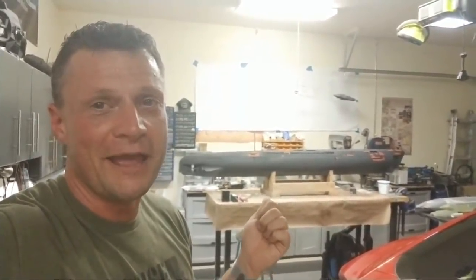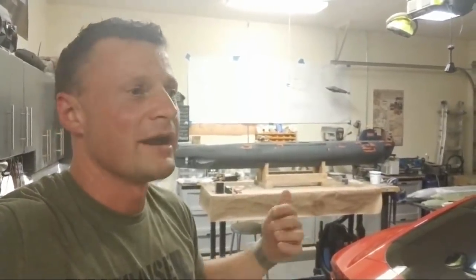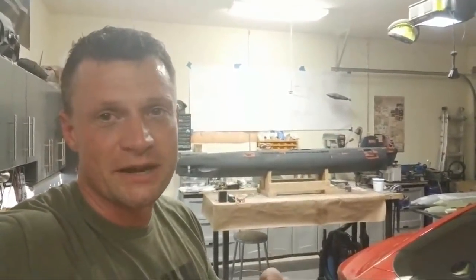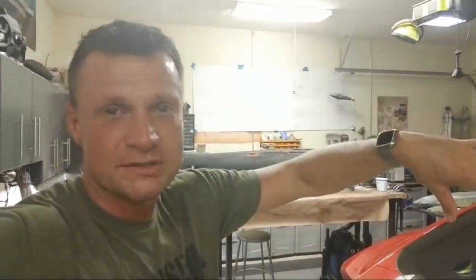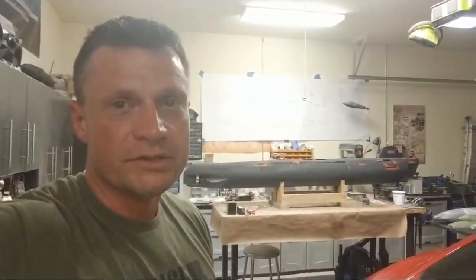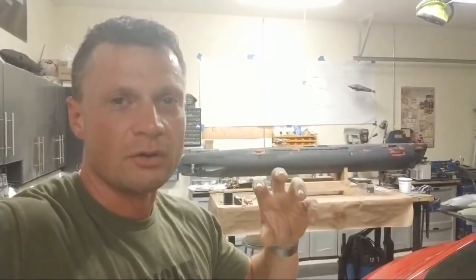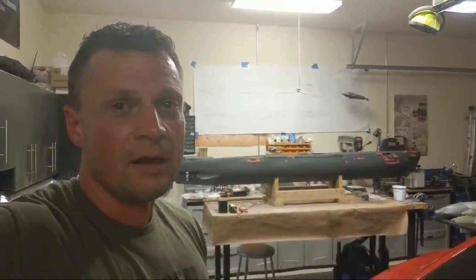That is very heavy and cumbersome and prone to damage and hard to transport and hard to store. You're sealing a tremendous surface area when you've got those big doors, those big hatches on the top. All of that perimeter needs to get sealed, and it needs to seal perfectly. With a cylinder, you're sealing a circular circumference on a small surface area. It's much, much easier to control, and it's much higher in the likelihood that you'll be able to maintain a good seal on those cylinders.